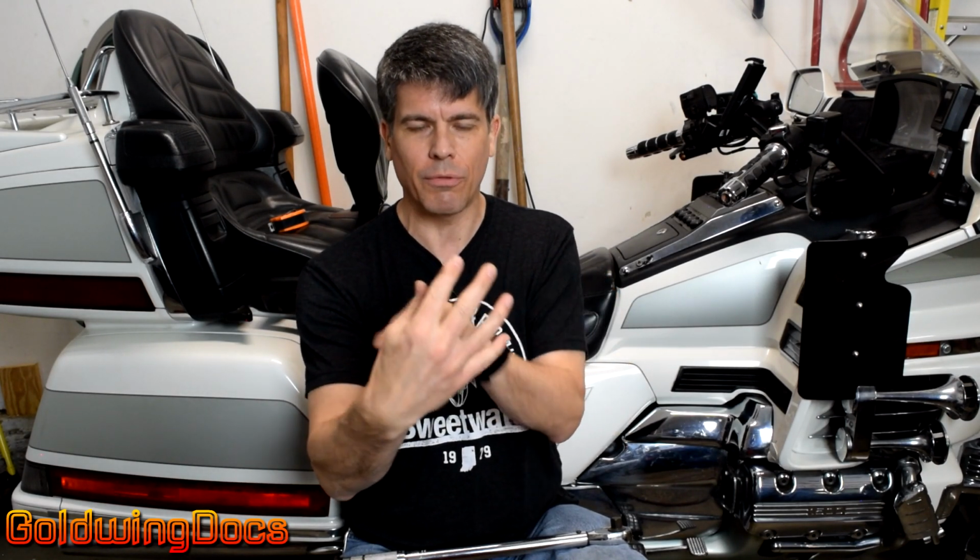The thing is, wheels on cars, and more importantly, the brake rotors on cars, are particularly susceptible to uneven torque. So if you have 5 lug nuts, and 3 of those are really tight and a couple are about to fall off because they're so loose, you've got uneven torque holding that brake rotor in place, and more importantly, uneven amount of cooling whenever that brake rotor heats up because it's fastened with different amount of pressure around the wheel. So as it heats and cools unevenly, the rotor starts to warp. You guessed it, the primary number 1 cause of brake rotor warping in cars is unequal torquing of the lug nuts. And that is primarily caused by grease monkeys in the garage with these.